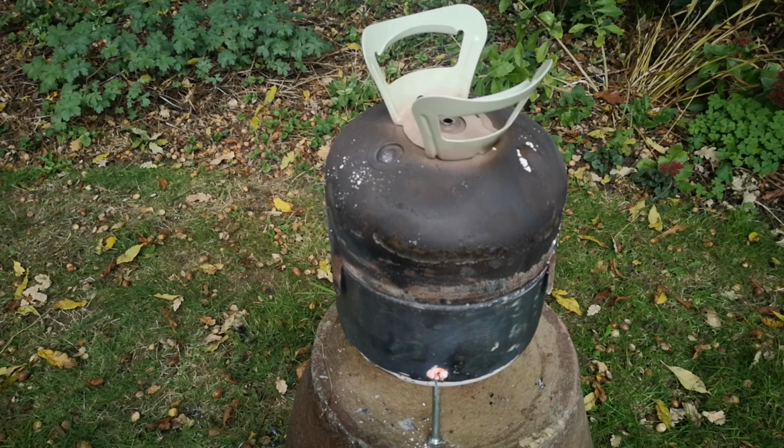Three reasons for putting the lid on. Firstly, it will stifle the fire a little bit. And this should hopefully create a reduction firing environment where the fire steals oxygen from the clay, reducing the minerals in it to a more metallic form, which supposedly is a good thing.